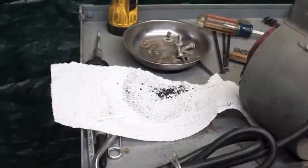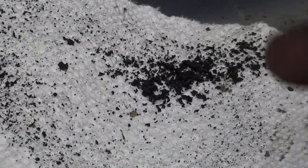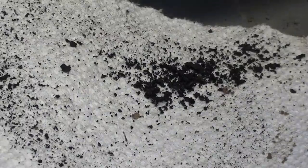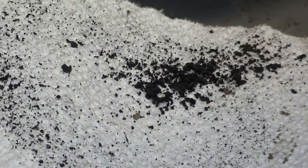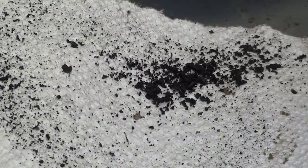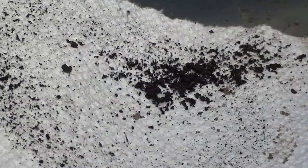It's a half hour later, and this debris that you see right here is what came off of the laminations in the stator. It's a very greasy dust. What has happened there, essentially, is it became a brake drum. That was the shoes pressing down on the rotor. So that's apparently all that was wrong, because of an open frame motor and because it was a little bit over oiled. So I think it's pretty good.